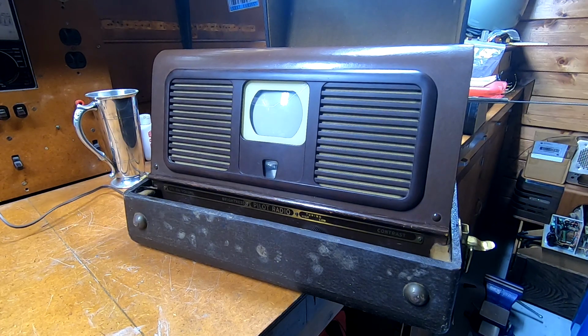Sorry for the delay between shots. Originally, as I was putting the thing back together from the last bit that I showed you, I got it packed up, I hooked it back up, and I was having all sorts of problems with the sync, and the video quality was really bad. I was getting popping and crackling, all sorts of artifacting in the video signal, and I conferred with one of my other collector buddies, and they figured it was probably high voltage arcing somewhere in a component, or a corona discharge from the high voltage supply.